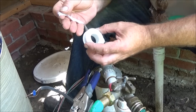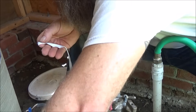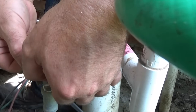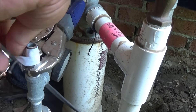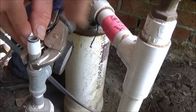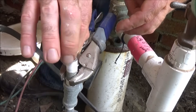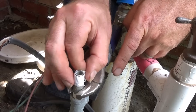This is a short piece of pipe tape, thread tape, or Teflon tape — I like this better than pipe dope. You want to make sure that you put it on in the correct direction. This is going to be turning clockwise when I thread it on, so you want to thread the tape on in the same direction. And you don't want the tape covering up the opening where the water is going to be coming up.